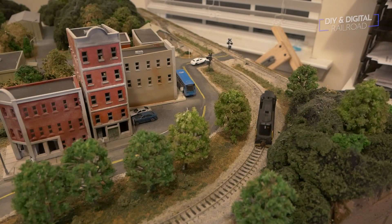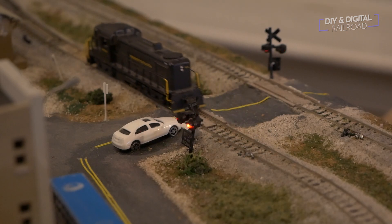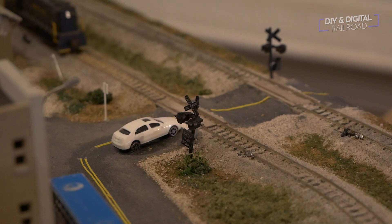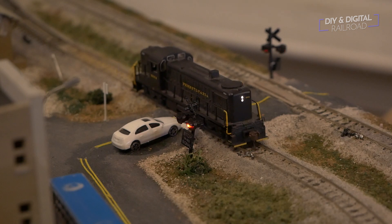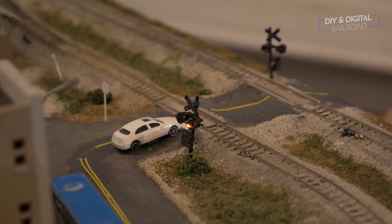Now for a test. As you can see, when the locomotive enters the detection zone, the crossing lights come on. We bring it in and stop the locomotive and turn its light off so that it's drawing the minimum amount of current. For your rolling stock, you're going to need metal wheels for at least one car, and it's going to need to have a resistor on it — or you need to pre-buy resistor wheel sets. If you want to make these yourself, I've done a tutorial on this — you can check that out up there as well as in the link in the description below.